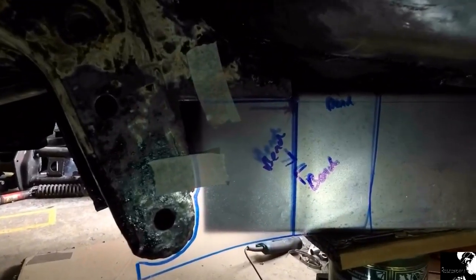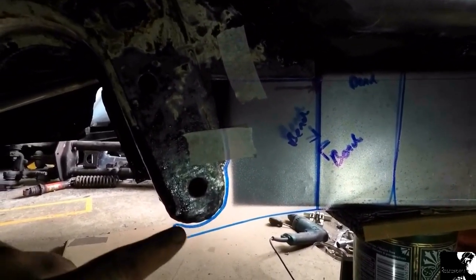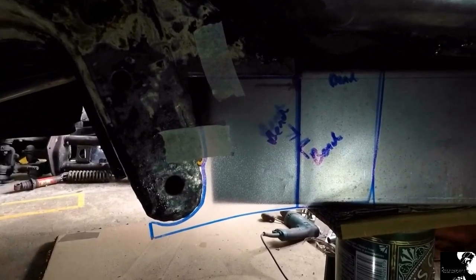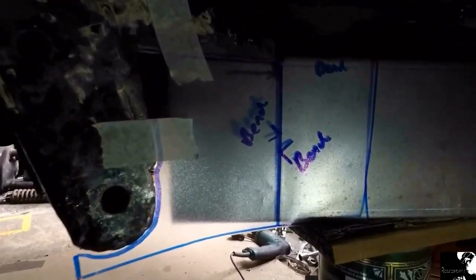I'm back to it, up underneath the front of the bus here, and this is the transparent template I've just created. I actually cut out a lot more rot and bad repairs in this section, so this will now be transferred onto 2mm steel and then cut out. And it also requires a bend to finish up right on top of the chassis rail up underneath there.